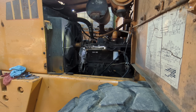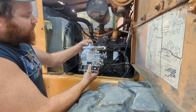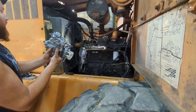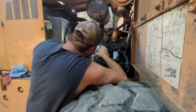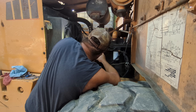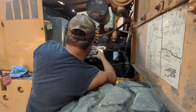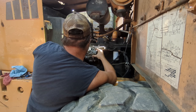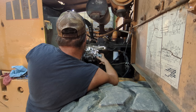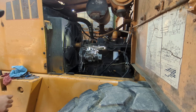We've got the pump ready right here. I put some white grease on the keyway to help hold the key in the groove. Hopefully we'll gently shove it in the gear and that won't come out of there — we don't want to lose that down the front cover. I think it started — I think it did. Now we'll just draw that around with the nut.